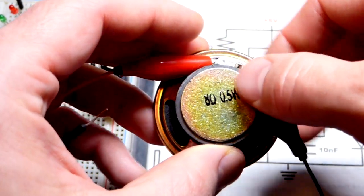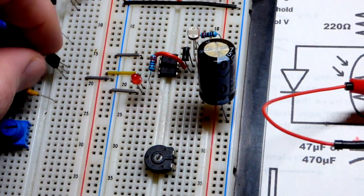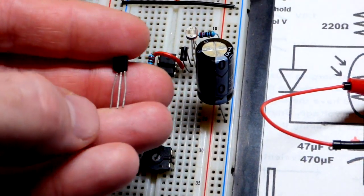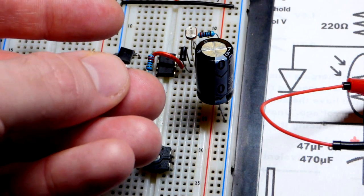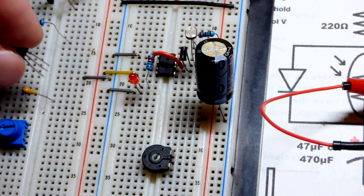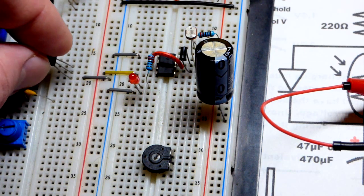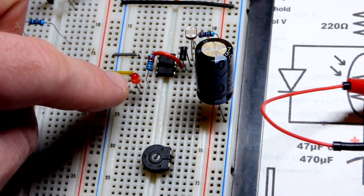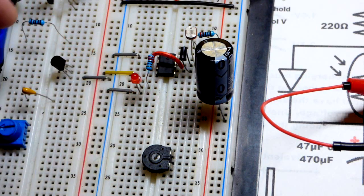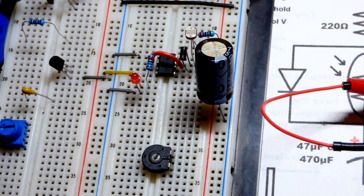I don't want to make the 555 timer have to power half a watt, so I have here an NPN bipolar junction transistor. Its pin layout is emitter on the left, base in the middle, collector on the right. This can handle up to about 600 milliamps of current. Plus it doesn't have to handle that all the time — this is off most of the time right now, so we'll get brief periods where it's on, which will reduce the amount of power it has to handle.